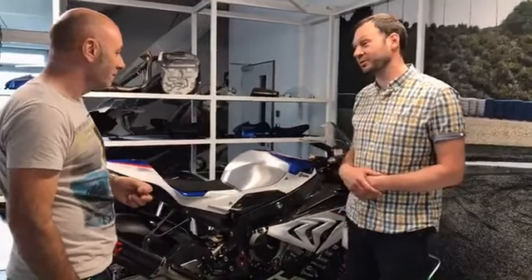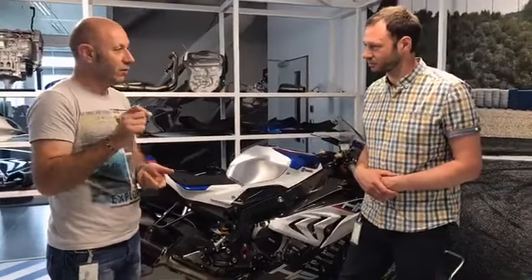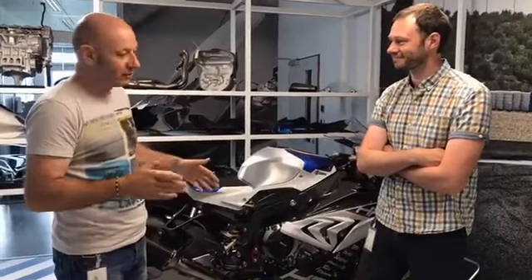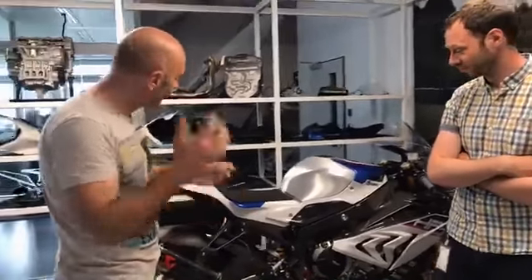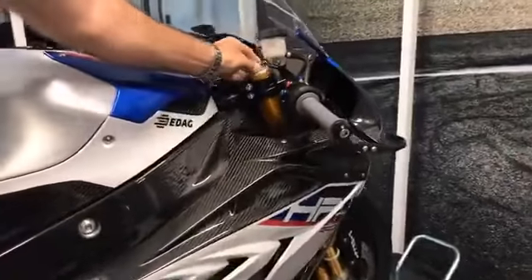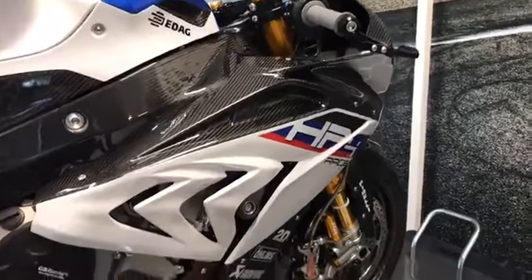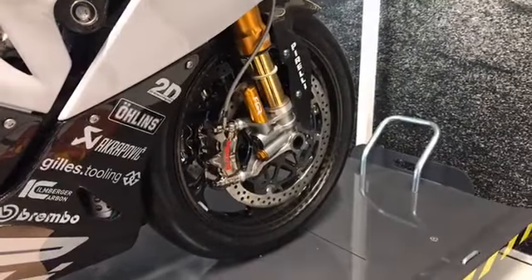So really it's lighter and more advanced than World Superbike? Absolutely. There's a regulation called Parc Fermé weight. World Superbike has to have 168 kilos — we have 160.5, and MotoGP has 157.0. That means we are just 3.5 kilos heavier than a MotoGP bike, and definitely less expensive than MotoGP. Cost-wise, you're looking at 80,000 euros, which at current exchange rates is 72,000 pounds. It's a lot of money, but if you go to Öhlins and ask for an FGR300 fork, that alone is 10,000 pounds, and the TXT electronics kit is another 4,000. So in the end, every pound, every euro is worth it.